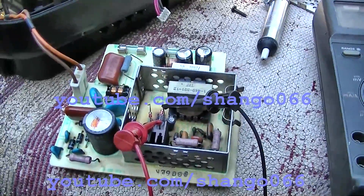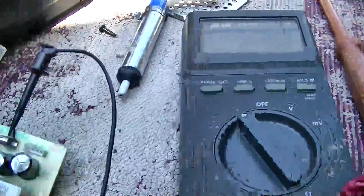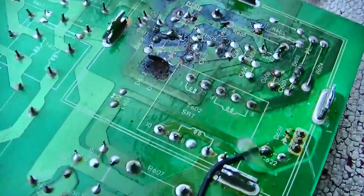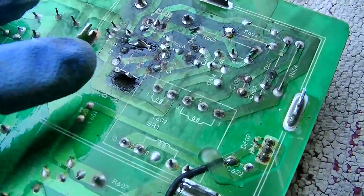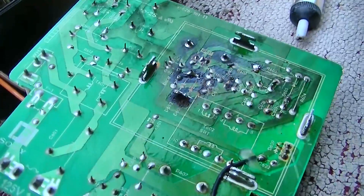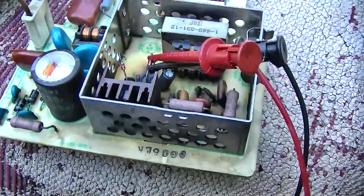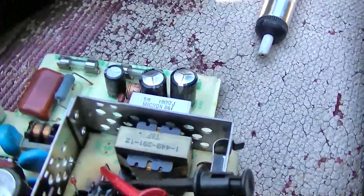We must have a high voltage problem here. Yeah — 40 volts. That'll cause the capacitors to pop. That's why I unplugged it from the TV. I think I see the problem: the board is so baked that the diode was not making good contact, and that's why the voltage ran away. Let's try this again. That looks a little better — we have about 11.5 volts across the Zener diode, because it's in-circuit now like it should have been before the capacitors got sacrificed.